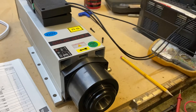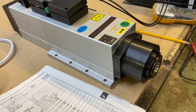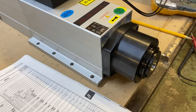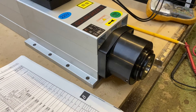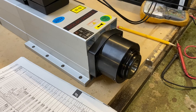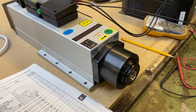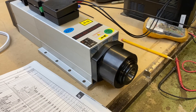At 350 then 400 hertz — that's as high as the VFD output — so that's 12,000 RPM. Dead smooth, dead cool, and virtually silent. You can probably hear more via the phone picking up high frequency noise. Pretty cool. I'm just going to check the air electronic tool eject and insert sensors.